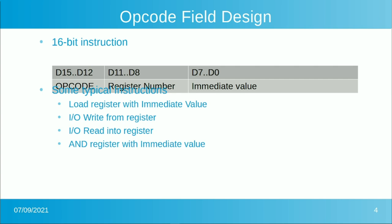The program space is completely different from the I/O space — it's not a unified address bus like you'd find in a 6502. The program space is completely internally located, and the peripherals are separately connected. Similarly, an I/O read would be the same format, and an opcode like AND — ANDing the register with an immediate value — would be very similar as well.